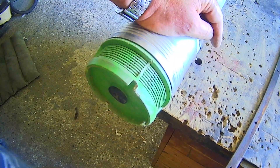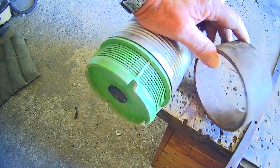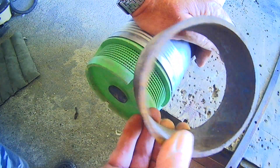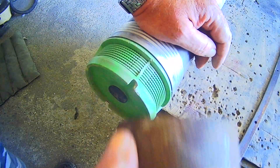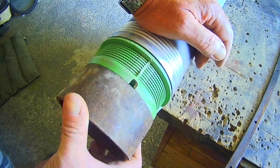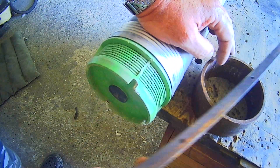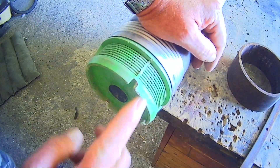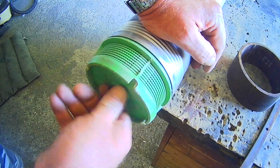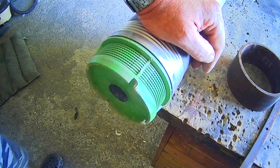What I'm going to do is bend that piece of steel around this piece of steel pipe that I've got — use this as a former. I keep these so I've got a couple of different sizes to form circles and things like that, and this is almost the right size. I'm going to bend this up around that, make a cross with a bit of extra steel to go through there, weld it all together, and put a big bolt or nut on it so I can put a socket on it and turn this, hopefully get inside and see what's going on.